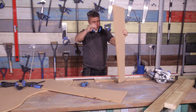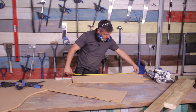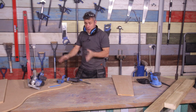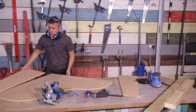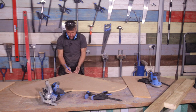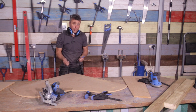In the next cut, I need to work out how high I want my desk — about 800 millimetres high, so I've got a small bit to trim off the bottom. That's the two brackets now made for the corner desk. On the top of the corner desk at the back, I'm going to cut a small round hole with the hole cutter, just round about here. We don't want it too close to the corner because there's a baton on the underside all the way along finishing just before the bracket. I'm going to cut a hole about 65 millimetres, which is perfect for a moulded plug to be able to slot right through.